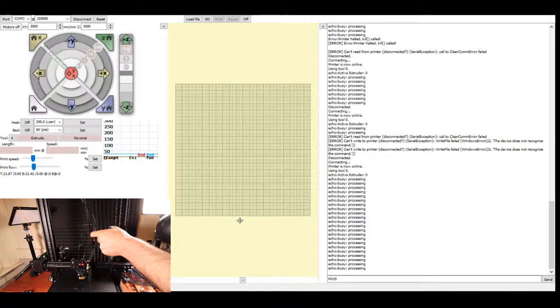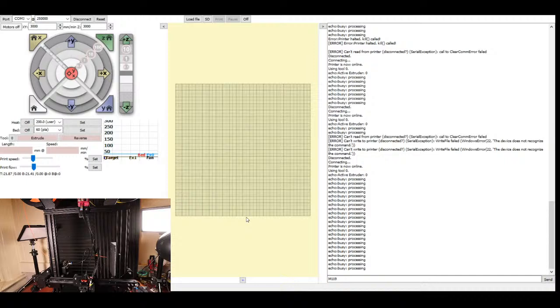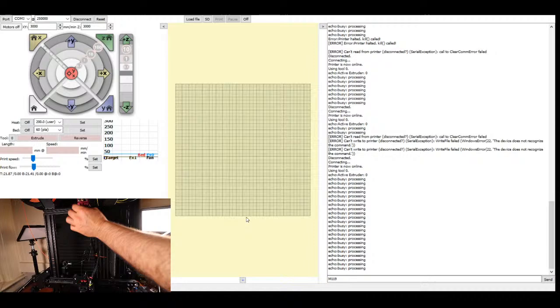I usually disconnect them, and then I'll run filament through. Let me bring the camera angle up a little so you can see what I'm talking about. So at the very top of the printer, I'll disconnect this when I'm initially working with it and feed in the filament above without this cord here so I can measure the actual distance it travels. And that's how I use it to tune it.